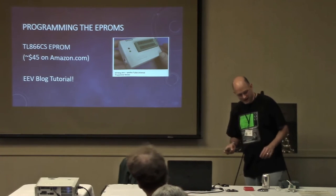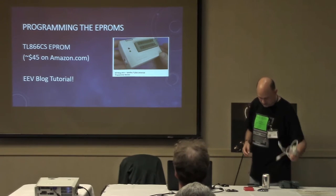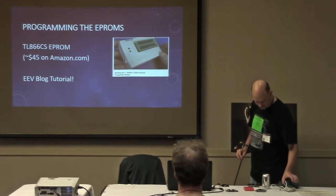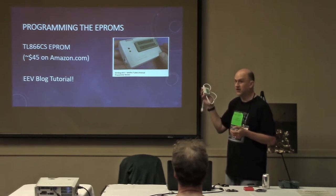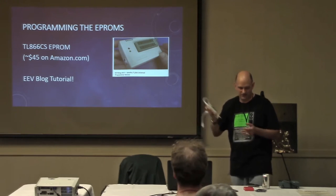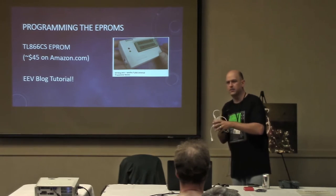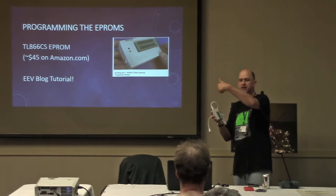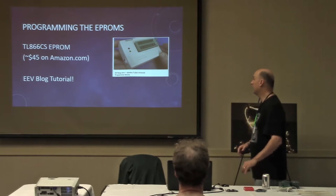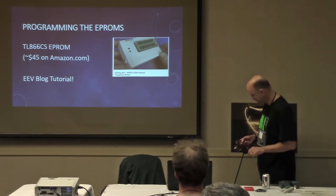To make a cartridge you need an EEPROM programmer — something that will take that CCC file and dump it into a ROM chip. These chips look like dead caterpillars. I had no idea what these things cost, but it turns out you can get an EEPROM programmer on eBay or Amazon for about $45. If you pay for the deluxe version, they give you add-ons for programming chips with different packages like pin grid array. I just got the bare-bones one for $40 or $45.